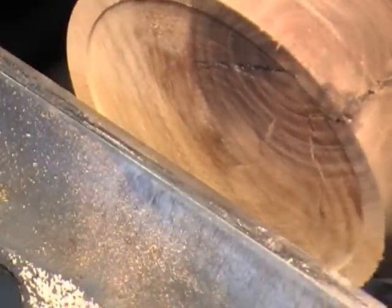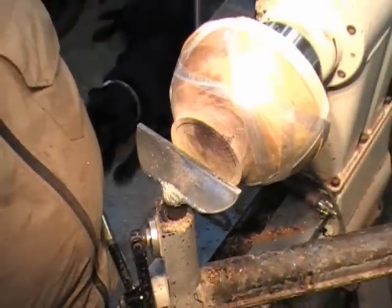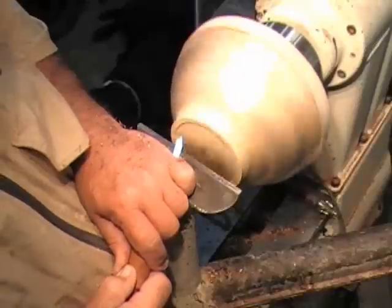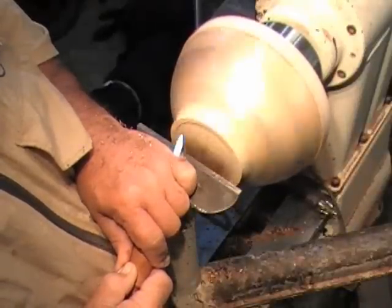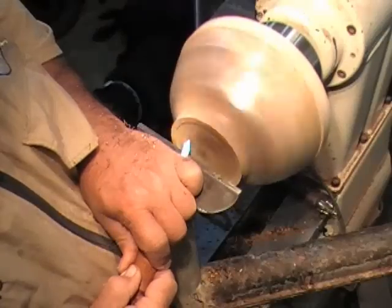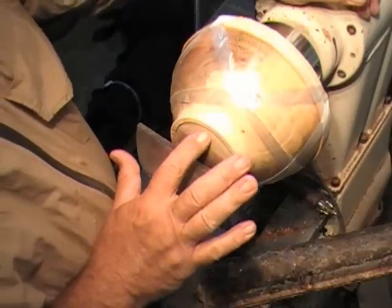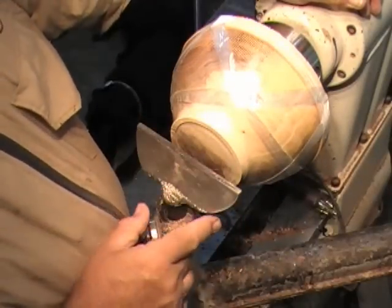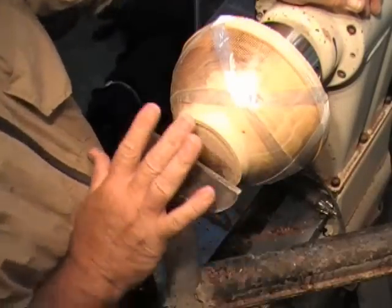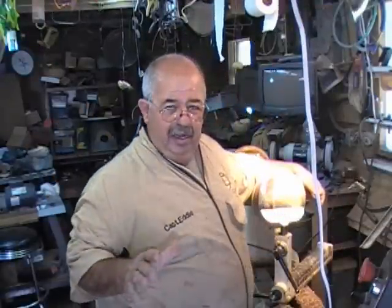Now, if I wanted to get a little bit fancier, and I often do, I sign my pens with three stripes. So I would take something like a little multi-tool and just step in a quarter, put a line. Say I want to put my letters about a quarter, I'd step in another 3/8 and put a line. That gives me something to work with to line my lettering of my name to go around. It took one cut. Now sand everything else after the inscribing, and then they lay down real nice. That's clean, simple, two lines.